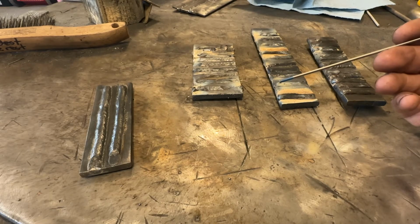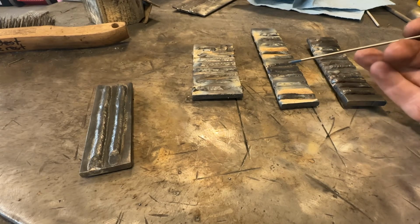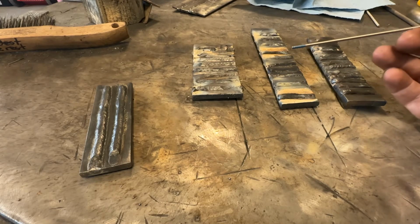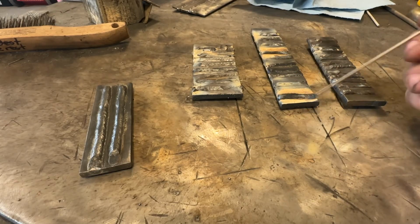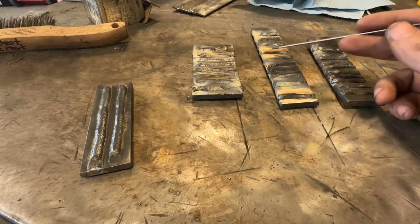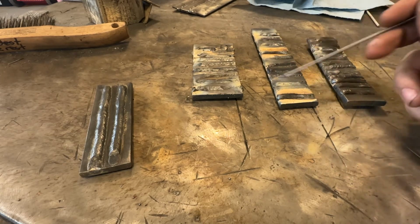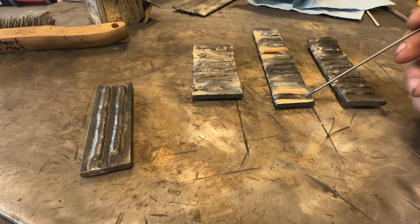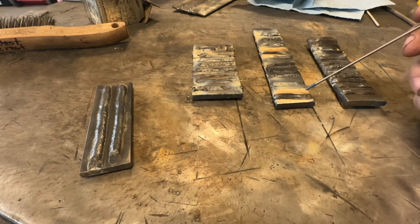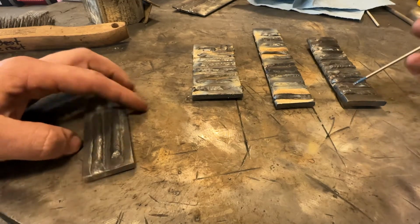And if it's out of line too far, you're going to lose penetration, or you're going to run excessively hot and get undercut, etc. Now, one of the things I did after I cut the camera off is I ran a bunch more test welds and adjusted settings on my welder to try and eliminate some of the starting and ending porosity that I was seeing. And like I said in the video, not to put much weight in that, and by just changing a few settings on my welder, I was able to pretty much eliminate it.